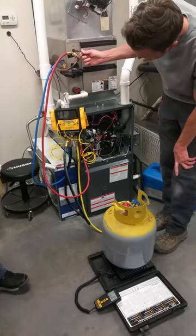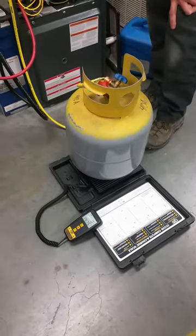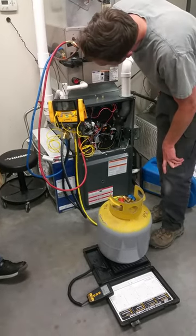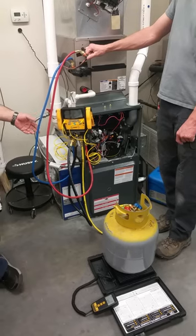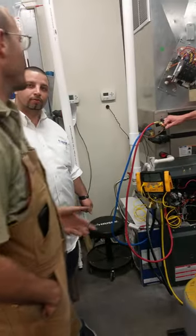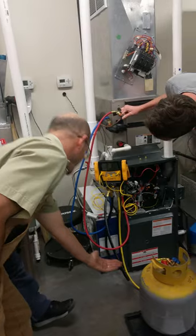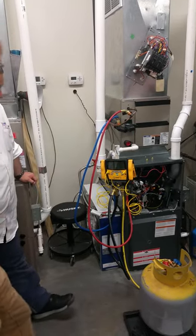So we just turned the AC on. The AC is running — it's getting heavier. We're utilizing the compressor outdoors. The compressor is pushing refrigerant through and filling your recovery tank. We want to stay on the high pressure side to overcome the internal pressure of this tank. The suction side is down to only 78 psi — here we're at 195 psi — and we're loading this tank. One pound.